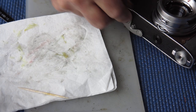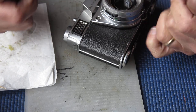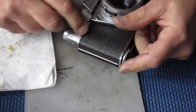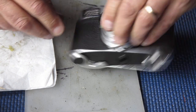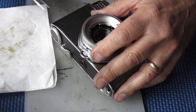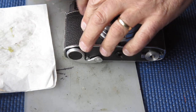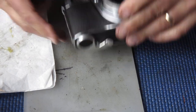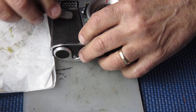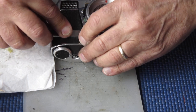That's nicely centered up. With leatherettes, you often get some shrinkage in them, so they don't always meet from one edge to the other. So if you're going to be left with a gap, even it out so you've got an even smaller gap on both sides rather than one big gap down one side. And it'll be all but invisible. That's quite good. We still have our crease in the leatherette at that point, but it's by no means as prominent as it used to be.